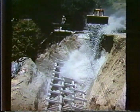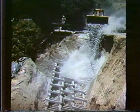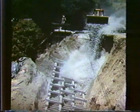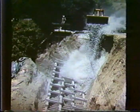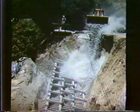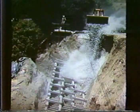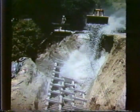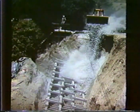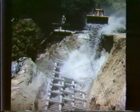Remember, as you can see here, the bins are rather small, and if you put in a cohesive type material, then a lot of effort of moving tampers around between the bins will have to be expended to backfill the structure. So there are some compensating factors here: is it cheaper to spend some extra money on the backfill material and expedite construction, or is it cheaper to use on-site material and spend some extra manpower in construction of the wall?